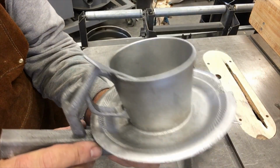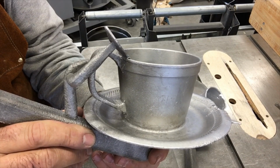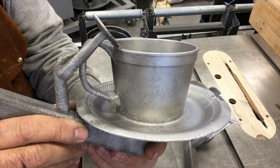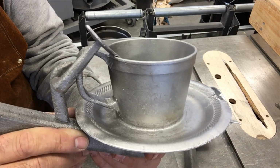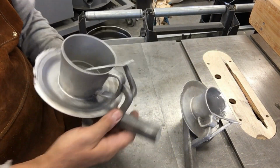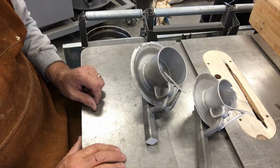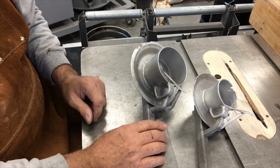And of course, the other thing that was different on this larger one is I actually had about 13 inches of mercury vacuum, whereas on the other one, I only had 7. So I staged the pumps and drew an extra 5 inches, so that was almost half an atmosphere of vacuum pulling on this one, and it just about got there. And I said that I wasn't gonna waste my time, and if I didn't get it on these, I wasn't gonna try again, but I'm a stubborn son of a bitch, and I am not gonna quit, because I think I can get this thing.